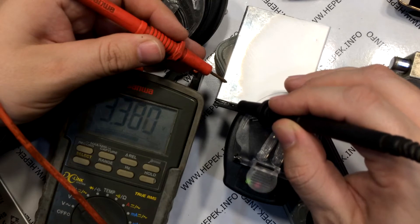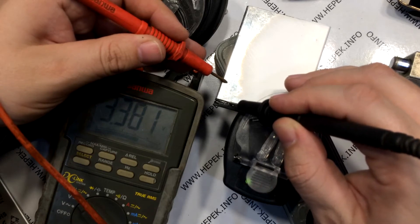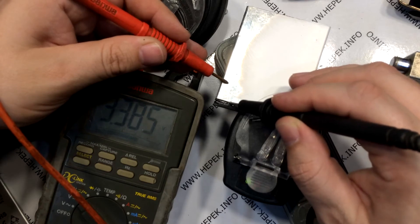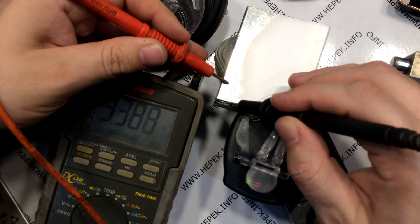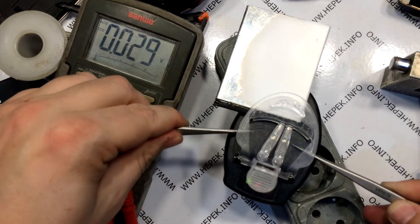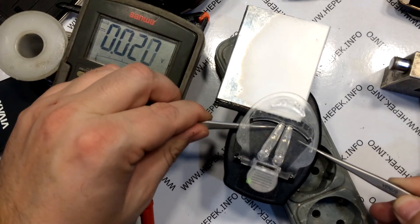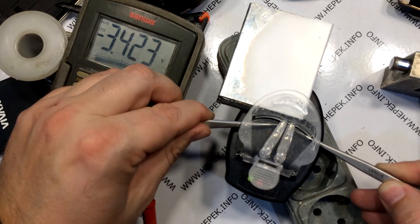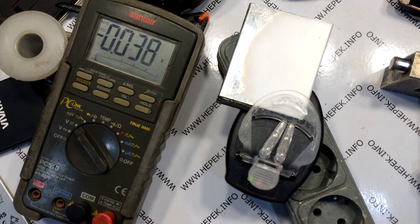All that while the battery was charging, I measure this by measuring the cell wall — which is how we establish the positive terminal of the battery — and between the cell and the plastic I measure the negative terminal. We see it slowly approaching 3.4 volts. Now I have decided to measure the voltage directly on the battery contacts. I will do this by placing two tweezers on the probes of the instrument to serve as an extension to reach the battery contacts. And we see that we have crossed 3.4 volts. I think that should be enough.